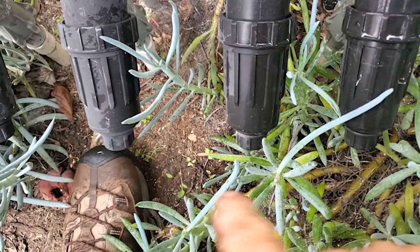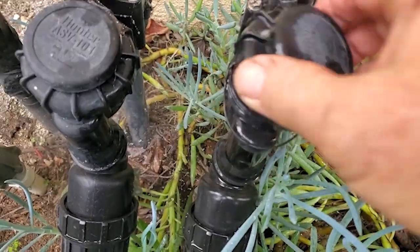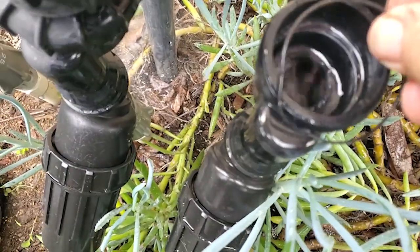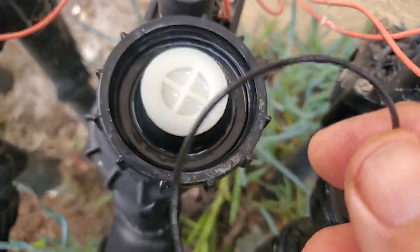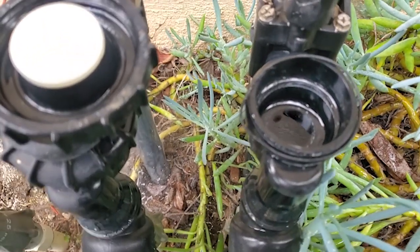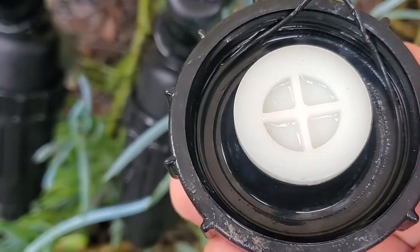The homeowner said she had noticed this area getting wet. I turned each of the valves on and when I hit this one, water was squirting out — I could see it was coming from underneath the anti-siphon cap. I unscrewed it and found that the O-ring was mangled, hanging down below. Unfortunately you can't buy just the O-rings from Hunter, so you have to replace the entire anti-siphon cap. I did try to push the O-ring back in, but it was so stretched and mangled that it just wouldn't seat properly.